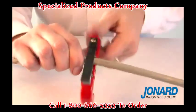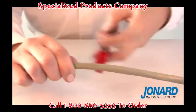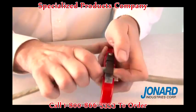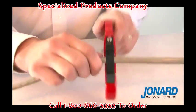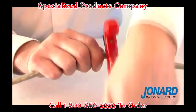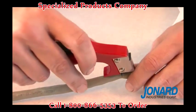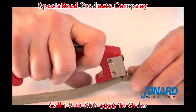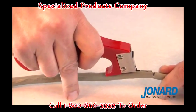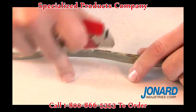Following a few simple steps, the JIC4366 can perform a mid-span slit on a cable. Once you determine where you would like to open the cable, use the mid-handle blade and ring the cable one to two inches above and below the area you wish to open. Once you ring both areas, place the blade guide between the conductors and the cable jacket and pull. The jacket will pop open and come completely off the cable.